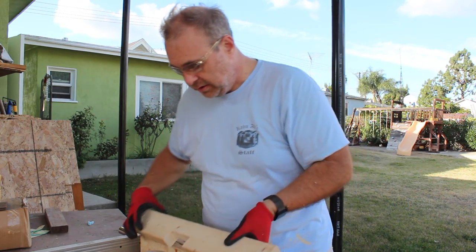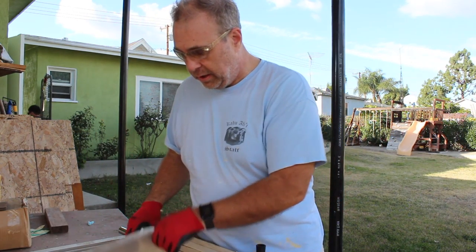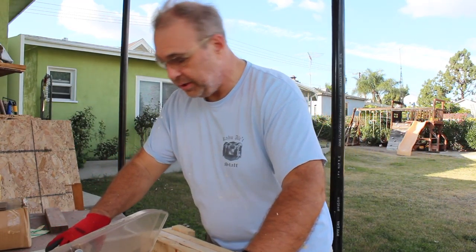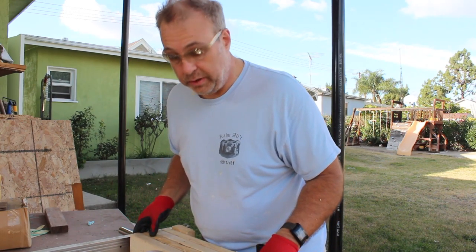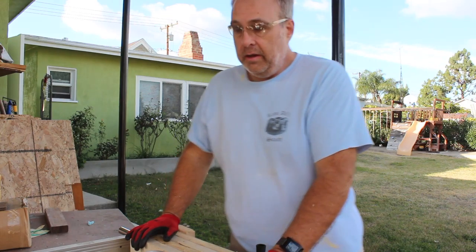And so the easiest way to do that is put it on a saw table like this, and you just run it up over the blade to cut a bunch of slots, and then when you're done, you go back and forth and you clear it out, and that's how you make a slot like that. That's the easiest way to do it. Let me adjust the camera for a tighter shot so you can see the work, and I'll go from there.